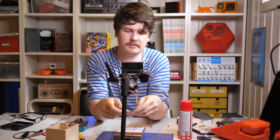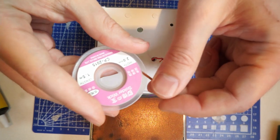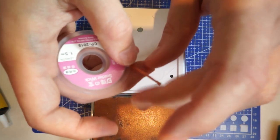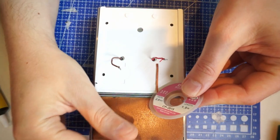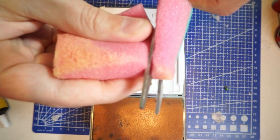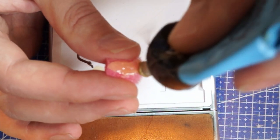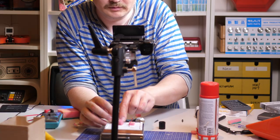Now it's time to create spring contacts. I'm going to use soldering wick for this because it's made of copper, so it's a good conductor of electricity and has a good width to it. I'm going to mount one here and one here, and then use a piece of kitchen sponge underneath to make a little flexible cushion that will push it up. You want to have good contact with those switches here. Leave the glue for a couple of minutes.